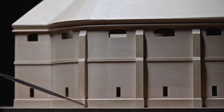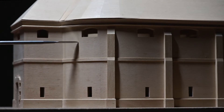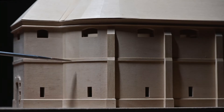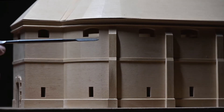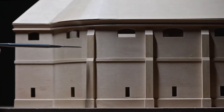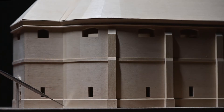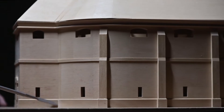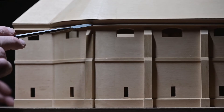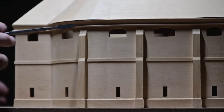It gets more complicated around the back because we're running on a radius. This has all been cut and mitered as straight flat pieces, and then I made sanding jigs to sand the outside and inside to get a perfect wall thickness. These pieces were steamed a little bit just to bend them and then glued on. It's all glued together with PVA adhesive.